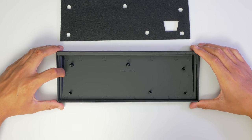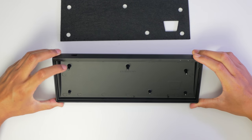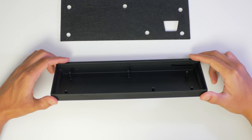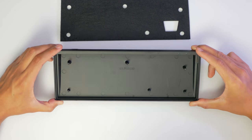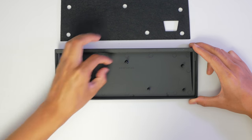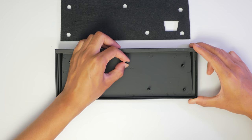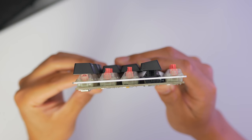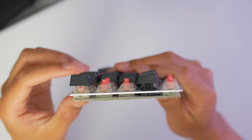And here's the base. The screw bosses are quite nice, but more interestingly, I'm curious how this was made. It has some curved elements, and also the space underneath where the LEDs shine through, so I guess this would have been casted, like the Poker 3 keyboards from Vortex, which also wasn't anodized, so maybe that explains it a little bit. It uses an aluminium plate rather than steel, which is quite often seen with aluminium cases.